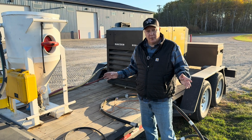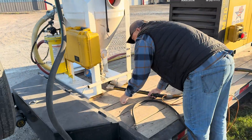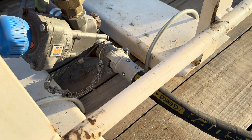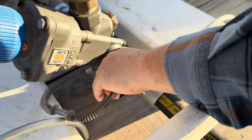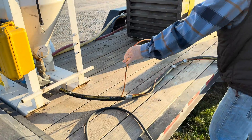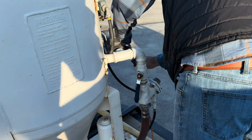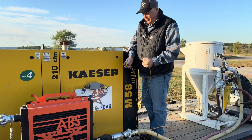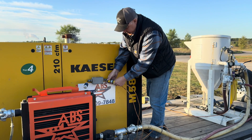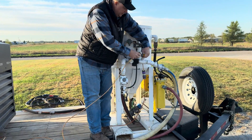Now we're ready to hook up our blast hose and get ready to get to work. We've got our 2-inch coupling — notice I've got whip checks on here. That snaps into place. I've got this clip and of course my safety whip check. I've got my power cord — you may have a pneumatic, but it's the same thing. This just happens to be teed into our battery on the compressor for convenience, but otherwise I would have alligator clips. So I'm going to hook up power to my pot.